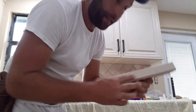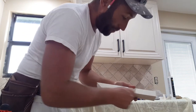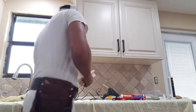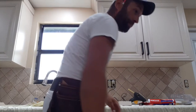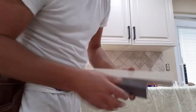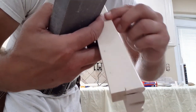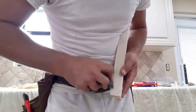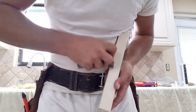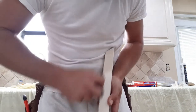What you want to do is take the piece you're attaching and rasp it up with a piece of sandpaper or a sanding block. Then just barely rasp the bottom of the cabinet where you're going to attach. So let's do that with a sanding block. On this one you don't ever see the top. You see the top. There's the line we marked, so you'll see all this top. You want to sand just behind that line there. It'd be the same up top as some regular crown. Take that shiny, smooth finish off, just a little bit. Heck, you could even do it in a couple spots.